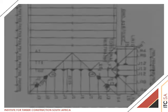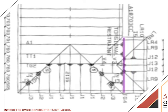The layout drawing shows the position of TG4 across the opening forming the L shape. We locate this position accurately by reading the two given dimensions from the end wall of the L on the plan. These read 759 and 760, which will be the correct measurements for the TG4 girder from the inside face of the wall.